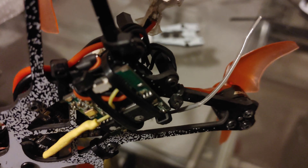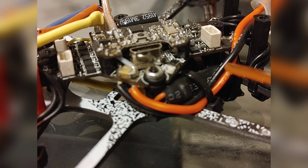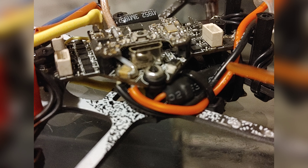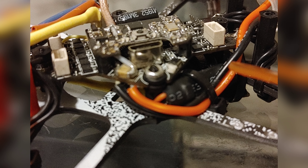Be careful when you do this to make sure you don't accidentally disconnect your battery leads. Make sure there's good contact with both wires, and leave enough wire so you can run them underneath your board and under the frame for the DVR.